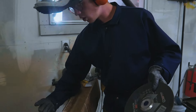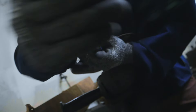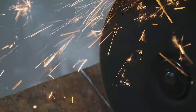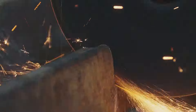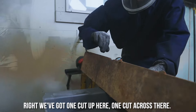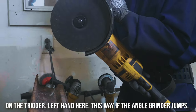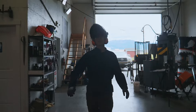I'm going to be cutting the whole way around all my lines, trying to minimize my surface area of contact. The way that I like to hold the angle grinder when cutting: right hand across my body on the trigger, left hand here. This way, if the angle grinder jumps, it's not going to hit my head. Let's go see Zach.